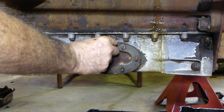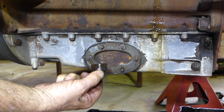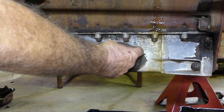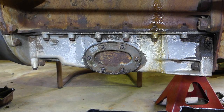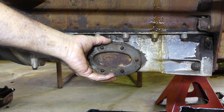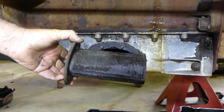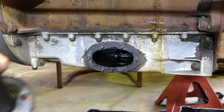We'll take all the washers so they don't drop in the oil. I've already dropped the oil - here's the oil plug, an inch and a sixteenth spanner fits the oil plug. If you've got an inch and a sixteenth spanner and an eleven-sixteenth spanner when you're working on Fergusons you'll just about be able to undo everything. This just comes out - there's a thick gasket there that's available. And that's the suction screen; this looks pretty good really. I've pulled them out and they've had a lot of rubbish on them, so that's one of the better ones we've done.